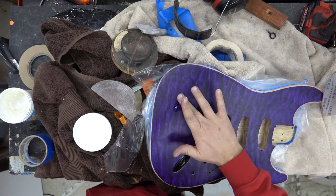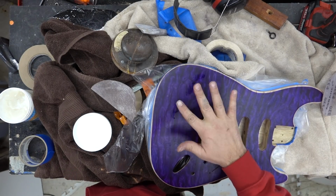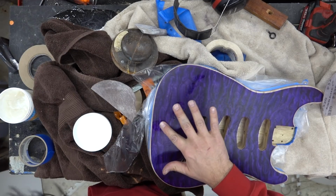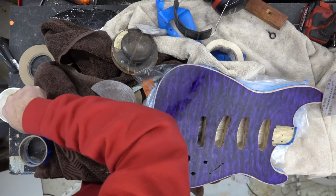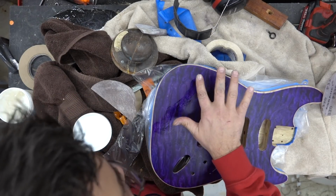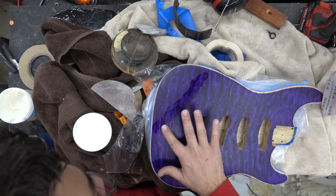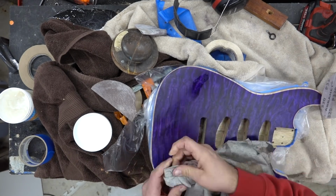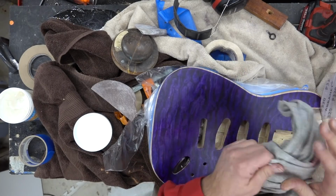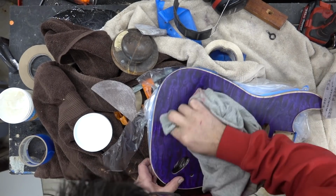Here is some aquafill wood filler in the 2 spots that have a little bit of a tear from the bend. What we'll do is apply the aqua coat, sort of smooth it off with some steel wool, and then go ahead and apply another coat of sanding sealer, and then we're ready for the full finish.